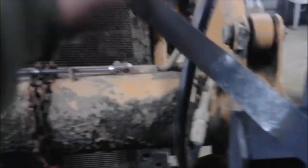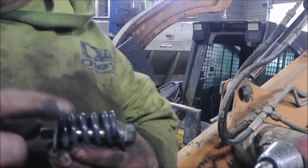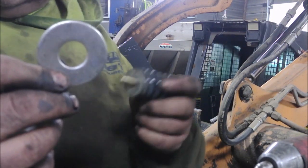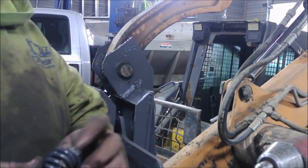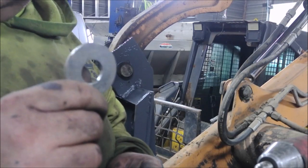There's a shot down in there — see what I mean. So this goes around a pedestal, and there's a washer under the spring. Well, that washer hits the pedestal before it's actually touching the lever. So when that happens, you don't get any pressure. But with this one, tighten that spring up, now it stays on its own, all the way up, on its own. So: washer, nut underneath, spring, washer, another nut. My solution is this — a bigger three-quarter inch washer that slides over that pedestal. Then this will be getting pushed on by the spring, it'll push pressure to the back of the handle, and our floppy handle will be solved. You call this sucker right here — you call that Viagra — that's going to make that thing stiff. Let's go!